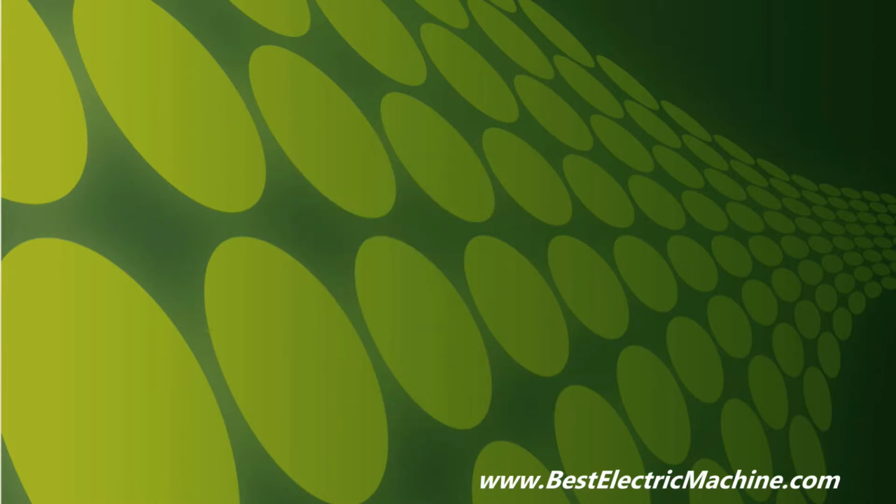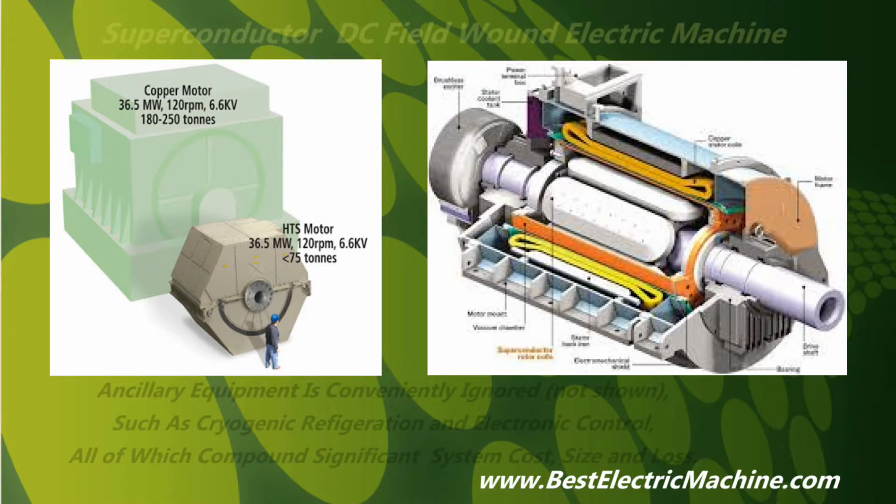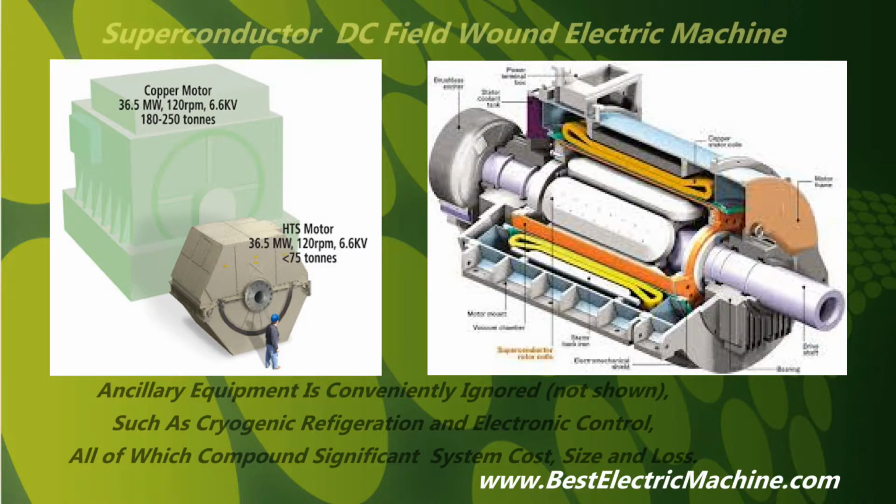The futuristic alternative to achieving higher power density, higher specific density, and higher efficiency, or lower loss, is the superconductor electric machine system. By typically providing twice the air gap field strength as a conventional electric machine, regardless of core saturation, with an ultra-low resistive loss superconductor DC electromagnet of very high magnetizing MMF, the superconductor synchronous electric machine easily provides twice the power density and specific density with higher efficiency than conventional electric machines, but only by neglecting the formidable loss, cost, and size of ancillary enabling components for functional operation, such as electronic control, slipring assemblies, cryogenic refrigeration, electromagnetic shielding, reliability, maintainability, safety, and etc.